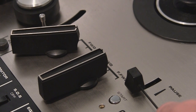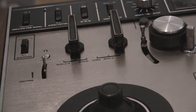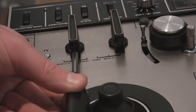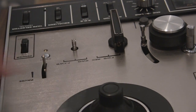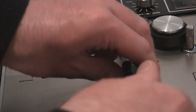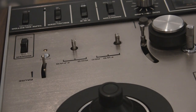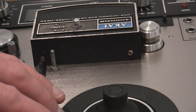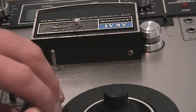We'll do exactly the same thing on this record pause button — just unwind it and lift it off and out of the way. Just turn the unit round now. As you can see on the top of these two control lines, it's just a Phillips screw again; just loosen those off and simply lift off. On the top of the tape cover there are two more Phillips screws to undo, so I'll just remove those.